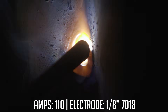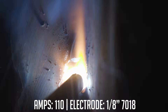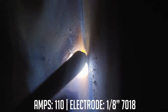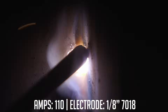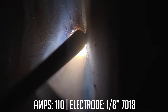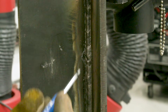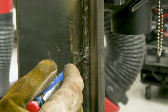Just as when we ran the tie-in in the horizontal position, I'm gonna start a little bit higher because now I have gravity working against me — probably about a quarter inch away from the end of this crater. I'll strike off in that area, come down and touch it. If you're not comfortable with welding yet, you can start up here and drag down; once you reach the spot, pull back a little bit, touch off with a little dip motion, then carry on like you never stopped. Once the edge of your puddle covers the top of the crater, just start moving like you never stopped. Right here's our tie-in — good tie-in, no cold lap, no overlap, everything laid in nice and smooth.